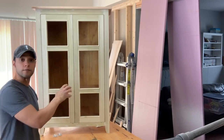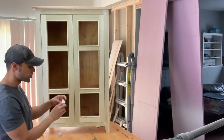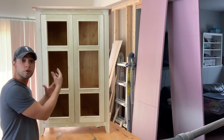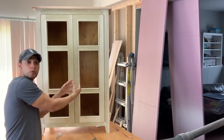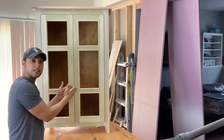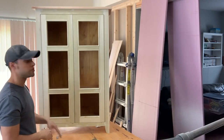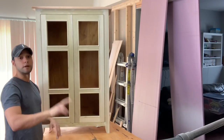I removed the glass because for the paint job I don't want to tape everything off — it's a lot easier since I'm going to be spraying both sides of the door. I didn't install the hinges yet in this video; I'll install them in the next video so you can see how everything works, because I have a certain reveal already for the hinges. They're going to have to be mortised a little bit, but what I'm anticipating is because this is going to be a waterborne finish with many layers of milk paint and some clear finish, I'm anticipating some swelling in the wood. It's going to expand a little bit, and the thickness of the paint layers will give me maybe a 64th or 32nd of an inch of film. Once that's all done, I'll mount the doors and mortise to the correct depth to maintain at least a 16th-of-an-inch gap reveal all the way around. Inset doors are very tricky, so we'll do the paint job before we hang the doors — that'll be in the second video.